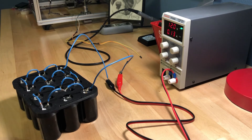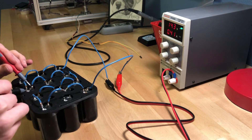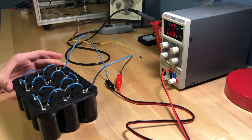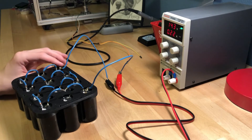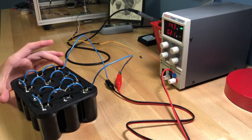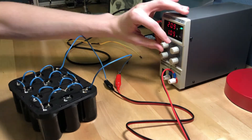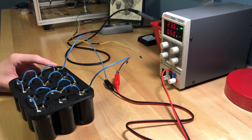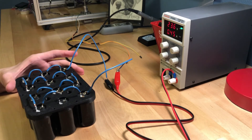I'm going to increase the voltage a little bit more. It looks like the capacitor in the corner is taking the most charge since it has the highest voltage, so I'm going to keep increasing the voltage until that one gets to around 2.5 volts — at that point any more increase could potentially destroy the capacitors. I've gotten the overall voltage up to 23.6 volts, still drawing half an amp, but I think that's about as high as I'm going to go since the capacitor in the corner has already reached two and a half volts. Now that this thing is almost fully charged, I think I'd better make some sparks.